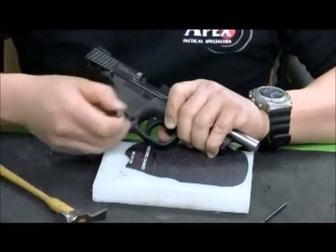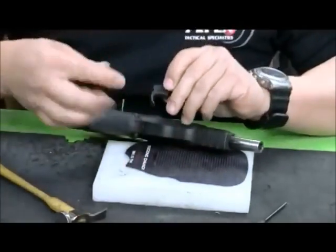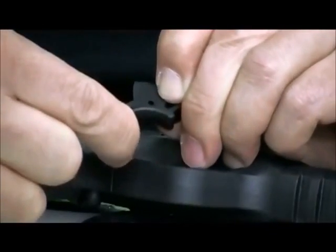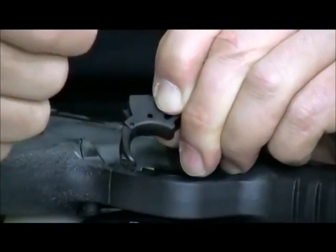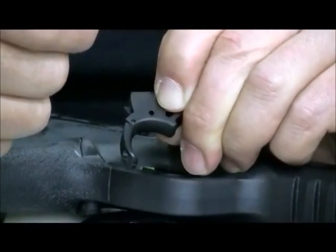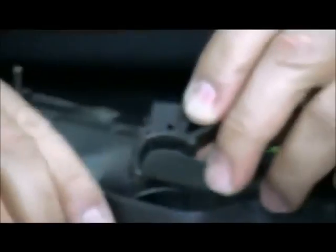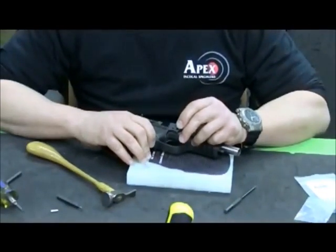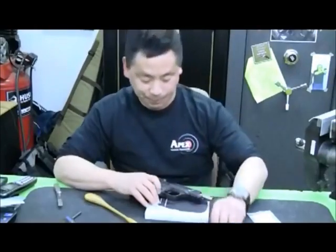The other thing that happens with the two-piece trigger is that if it stops, the bottom end of the trigger still is allowed to free float and move even further back. That causes stress on this pin that holds it to the upper portion of the trigger body, and that's where things can walk out as well. So if you're using a factory stock trigger and have adjusted over travel based upon the trigger bar or the sear housing block, just be aware of that.